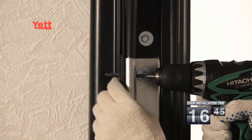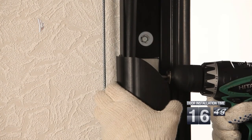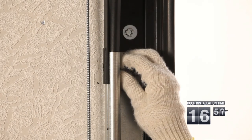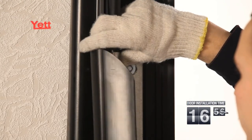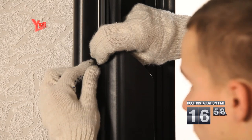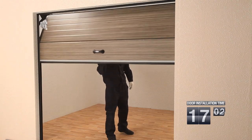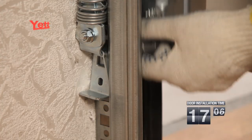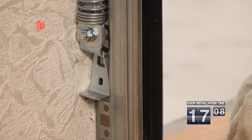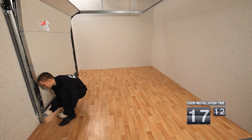For installation of casings, it is necessary to drill holes in casings on punching located on the vertical guides. Protective casings are fixed on vertical guides with the help of a bolted-on connection on all guide length. Adjustment of a spring tension is made with the help of a tightener installed on an angular rack. The tightener installation is made at the factory and delivered with an angular rack.